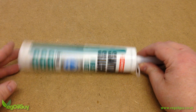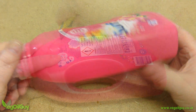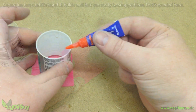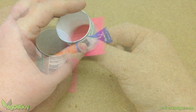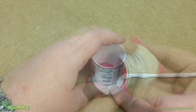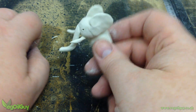From here I needed to make a silicone mould. This empty sealant tube was a perfect size. Cut down, it needed a base and plastic cut from a washing detergent bottle worked nicely. It just needed rubbing down with a little fine sandpaper and bonding in place with a few spots of superglue — or in my case, a pig's ear mess of superglue. It was unlikely to be watertight, so some plasticine — modelling clay, play dough, whatever you call it — was firmly squashed around the edges. Some might call this play dough, but this is serious and important work, so you certainly won't catch me playing around with this stuff.